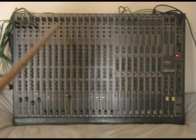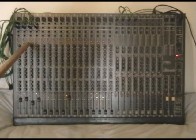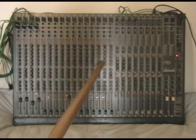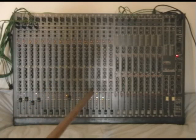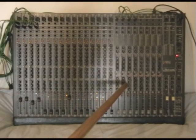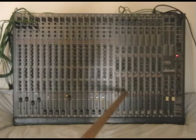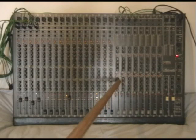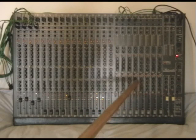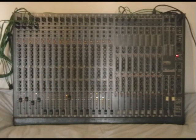When you're finally ready to mix, you switch all the input channels into tape mode and they receive the signal coming from tape, and you do your final mix using the full EQ and all the facilities of these bigger channels. But while you're recording, you can set up a monitor mix using these monitor tape groups, which have a pan and a volume control — hence a split console.